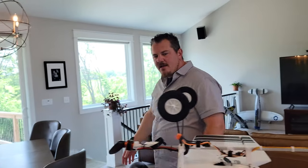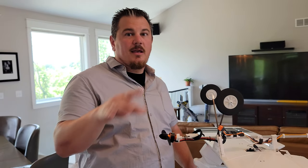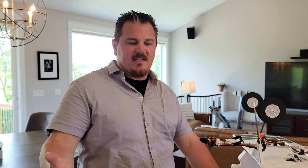And when you have a Gen 2, it discharges down to 3.9 versus a Gen 1, which discharges automatically down to 3.8. You can change that value. So if you know you want to change it from 3.9 to like 3.1 or 3.9 to 4 or something like that, you could do that, but you're going to deteriorate your cells quicker. The chemistry will upset faster. And then you start puffing, you start off-gassing in those cells, and then they get a little bit thicker. And over time, that just adds to more and more, and it just deteriorates faster. But every time you charge and discharge a cell in LiPo, soft packs especially, there's a little bit of deterioration. And that's why you only get so many cycles.